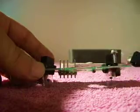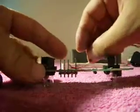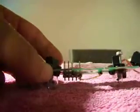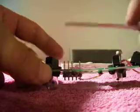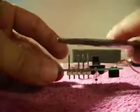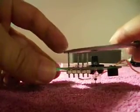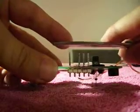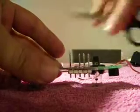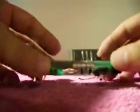So what I did is I took some desoldering rope and my soldering iron, and I just put the rope across the hard solder and melted the solder away. And once enough of it was melted away, I took a flat surface like these scissors. That's what I used. Obviously, without this screw here, I'll just flip this around real quick. And with the solder warm and most of it gone, I took this pin that was higher than the other three, and I just gently pressed down until everything was uniform. Obviously the scissors being a flat surface, that worked out.